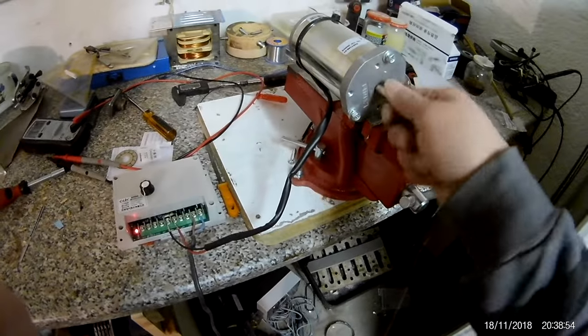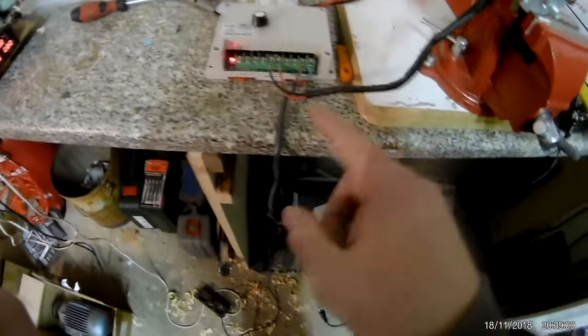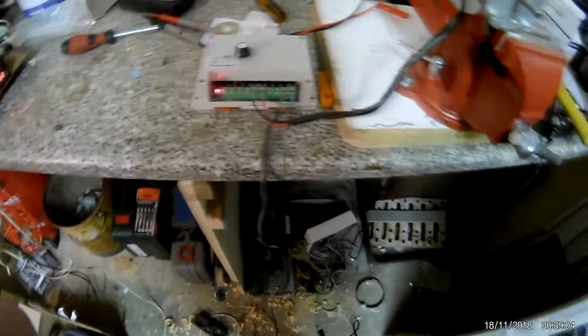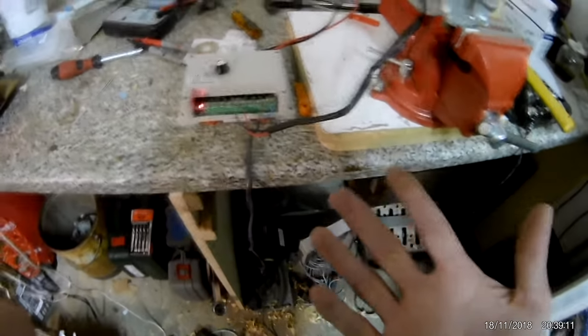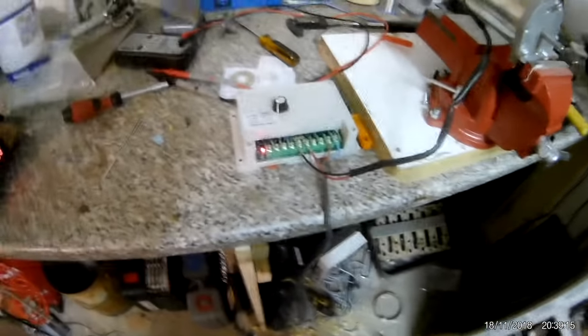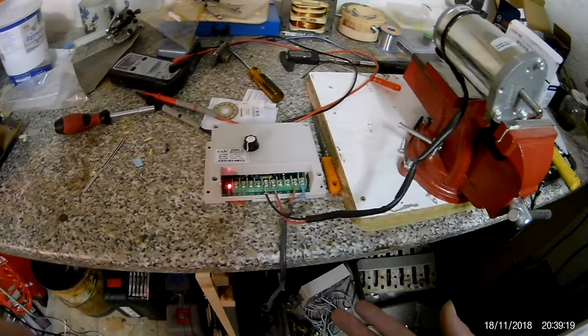That's not exactly nice. To be honest, I didn't analyze the output wave yet, so maybe it would work just putting a capacitor in there after the rectifier before the switching devices. But the technology tells me no, that won't work, because the thing can only turn off when you have almost no power going through it.